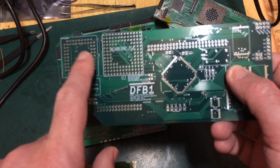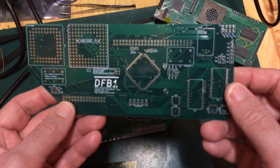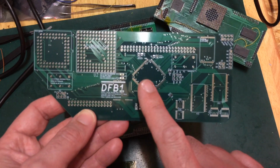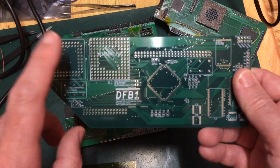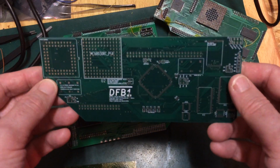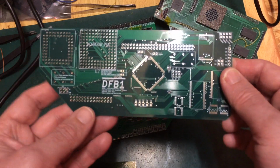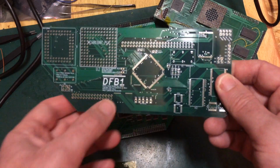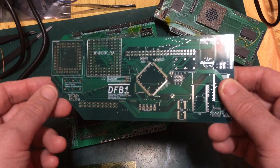What I found is that we can run the FPU anywhere between approximately half the CPU speed and the full CPU speed, but it has to be able to support it. So for example, I've got a 40 megahertz FPU, and you do have to test them. Sometimes they look like they pass, but then if you run all of the tests, it will fail on one or two. So I've got one that runs at 40, one that runs at 33, and one that doesn't get past 16. So for example, I could put a 40 megahertz crystal in here and get the maximum out of my combination of hardware, or optionally I can instead run with what I'm doing now and put in one of these resistors in place, and it will run at half the CPU speed.